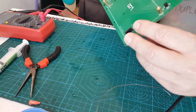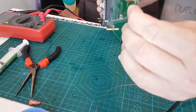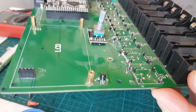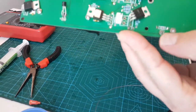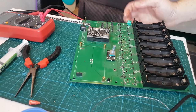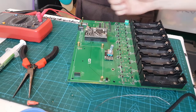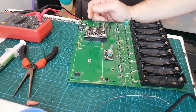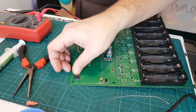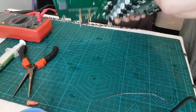Hang on - that's back to front! Oh shit, that's back to front there. The ambient one - that's the pad silk, so it's yeah, okay. When I was building those nine nano boards, I found I put one in back to front and it started smoking when I plugged it in. So it creates a short - maybe that's what shorted. I couldn't find a short before.